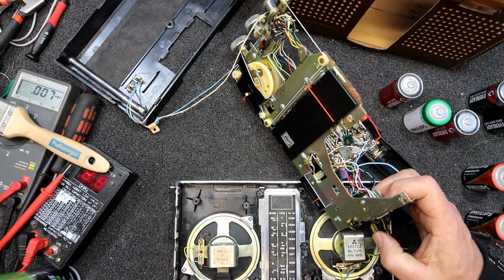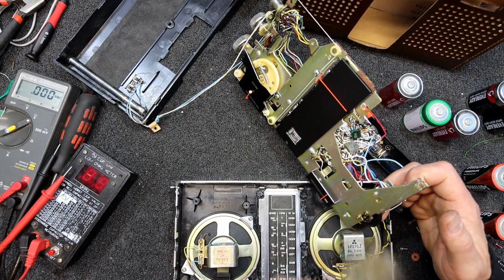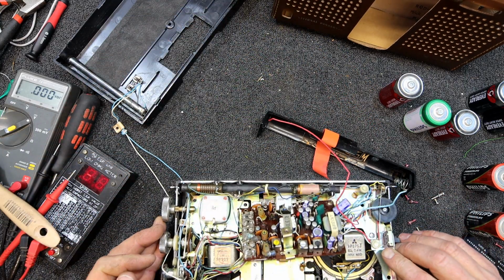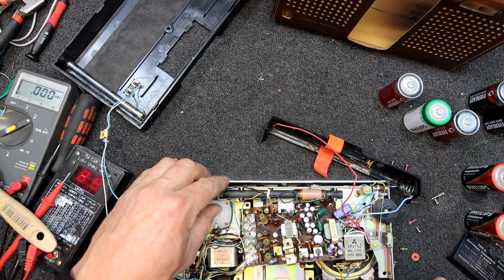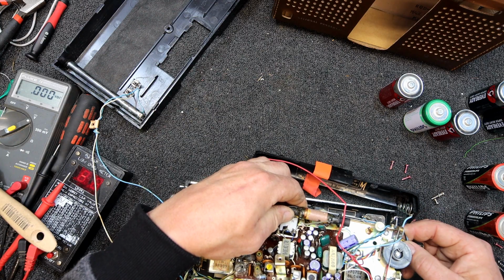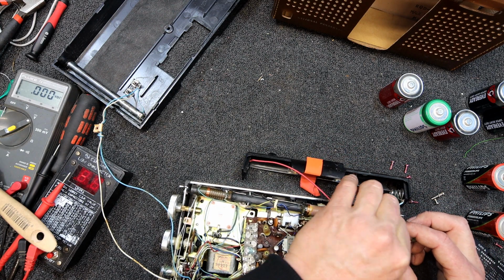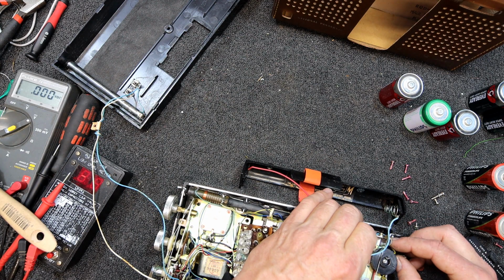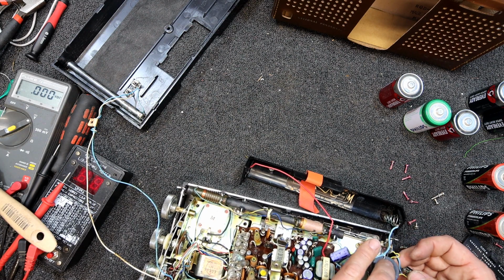But if worse comes to worst, normally you take the knob off, and then there's usually a plastic cover over the inside of the pot, and you lift that up, slide it up the shaft and clean that as well, and then lift that up off the shaft and then put the cleaner in. So you make sure you get it inside the pot. Now I've got to try and pull this blue wire back again, I guess. Certainly doesn't look like it's ever been apart before, which is probably the case. Normally very reliable, these sort of things.